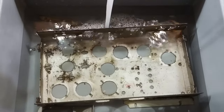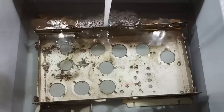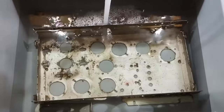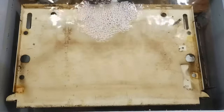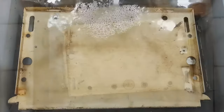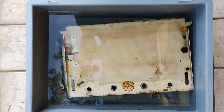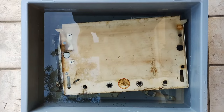The iron parts needed to be cleaned from rust and consequently also from the original protective paint. They were submerged in water, to which some muriatic acid was also added, less than 10% compared to the volume of water. The muriatic acid used was bought at a regular supermarket, where it is sold for domestic cleaning purposes.